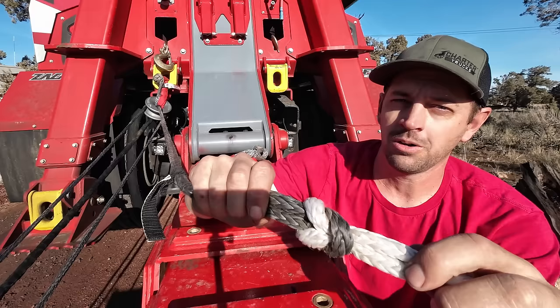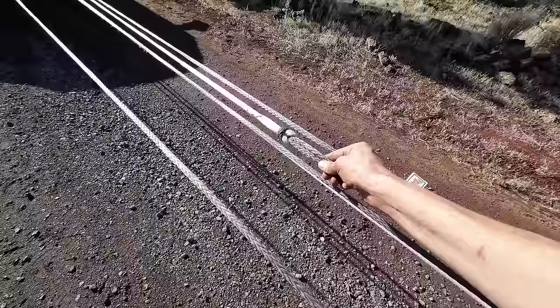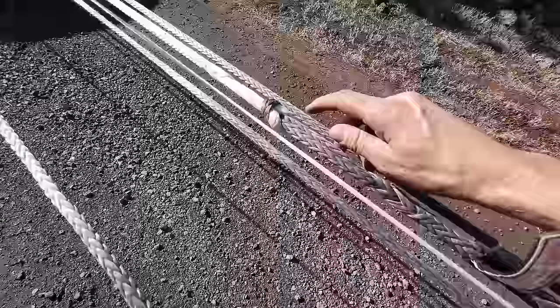This is a 15% reduction of working load limit, so keep that in mind. With our five-part rigging all set up and the extension connected in, please be careful of people who claim to be experts and are really just reading one chapter ahead of the class. You can see here: parallel legs, parallel legs. No twist in the fibers, no twist in the fibers. 15% reduction in working load limit. Good to go.